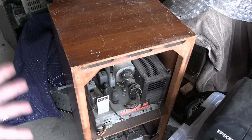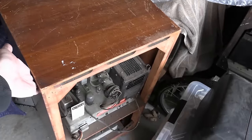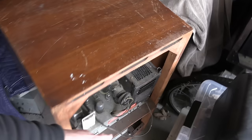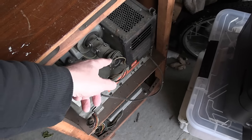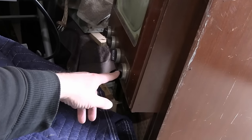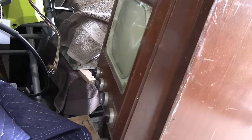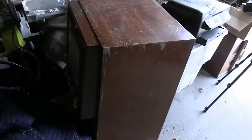If the chassis are secure and you want to transport it all intact, how do you lay it in your car? I like to put it on its side. I don't want to put it on the back because I don't want any chance of the CRT base getting damaged — even though it's pretty flush, that CRT base is right at the edge. A lot of folks recommend putting it face down, but I'm wary of that on this set for two reasons: one, the knobs stick out and I don't want to damage the knobs or control shafts; two, this bezel is plastic, and I'd be worried about cracking it — you're not going to be able to replace it, it's reverse-painted and specialized. So just put it on its side, which I did and had no issues.